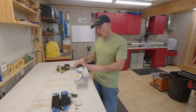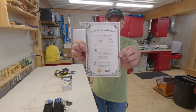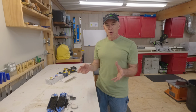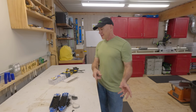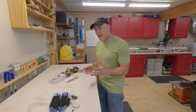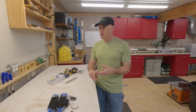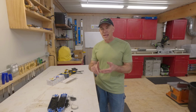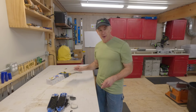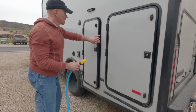And the Camco filters are certified, and they put like a cool little certification placard in the box with the filter, right? And so basically this is Camco saying, well, hey, don't just take our word for it. Listen to this guy who has the water testing lab and take his word for it that our filters do what they say they do. And the Camco Tastepure is certified to ANSI NSF 42 and 53 for chlorine, taste, and lead. And it has some additional certifications for being lead-free. It's all right here on the placard. So certification's kind of important because I don't know too many RVers that test their own water.